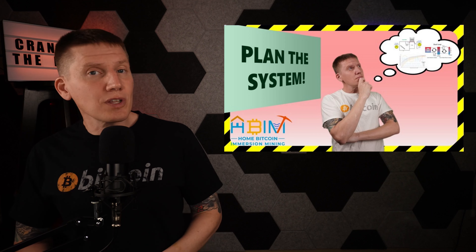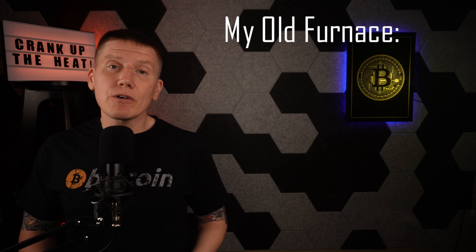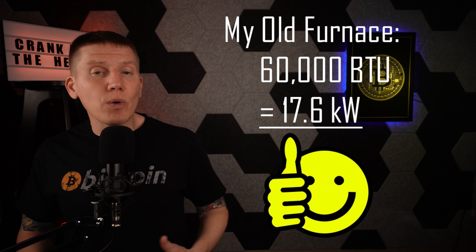This happened at the beginning of March, and I live in Colorado, so I knew I had a few more weekends left in that winter season. I could have panic-bought a new forced air furnace and paid whatever it took to get it installed quickly, but fortunately, as I noted in a previous episode, I have a large solar array installed on my house. So I decided to take my time choosing what type of HVAC system to install, and in the meantime, heat my house with a few electric space heaters. Looking back, I'm really glad I decided to do this because I learned a lot about how much heating my home really needed. The furnace previously installed was rated at 60,000 BTU or 17.6 kilowatts — it did a great job heating my home, and no matter how cold it was outside, I always had enough heat.